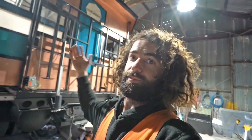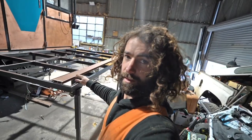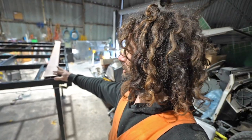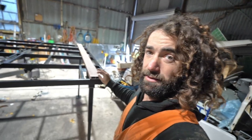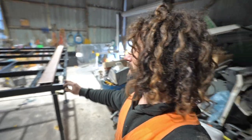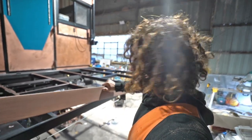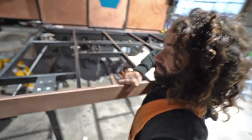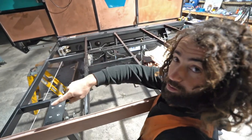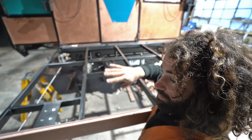I'll put the frame back down and have a look at the decking. The decking I'm using is aluminium decking — I got it from a company in Australia called Deco Wood; they make aluminium decking and facade products. It's basically a 3mm profile with a powder coated finish and some kind of grip surface. What I'm going to do is picture-frame the deck — put a piece of decking around the outside mitered at the corners, and then the decking boards will butt into this picture frame, giving it a really nice, clean finish.